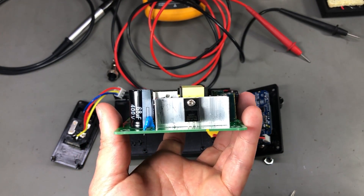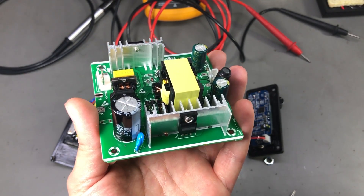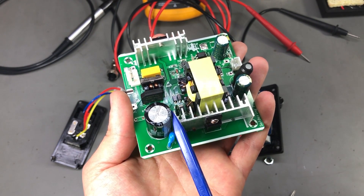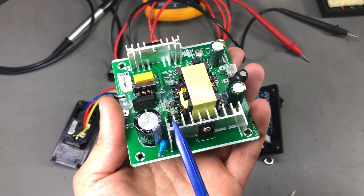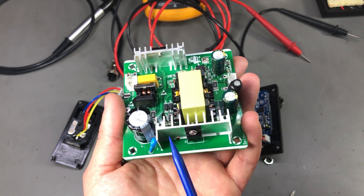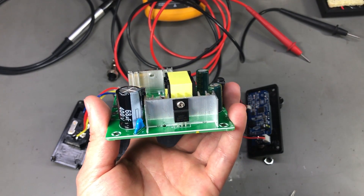But it's not impossible — they could fix it with a future revision. This is an important oversight because if this equipment receives a high voltage spike on the input and the input protection fails to catch that, it could potentially arc over to the secondary side. All that's separating the two like I mentioned is some solder mask between the PCB tracks and the heat sink.